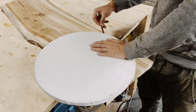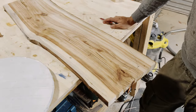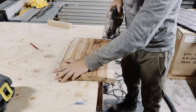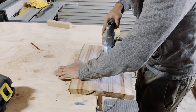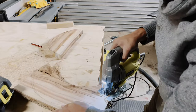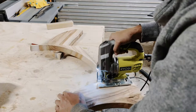The first thing I did is tracing out the form that I'm using for my epoxy pour and then kind of free-handed the moon shape that I wanted to have. After cutting this lamp to size we are unpacking our trusty jigsaw and we are trying to shape this moon. I'm going to go really close to the line — remember guys we don't have a template for this, so really go close to the line. If you have a band saw, even better. And now we can see a little bit of a preview on how the epoxy lamp will look.